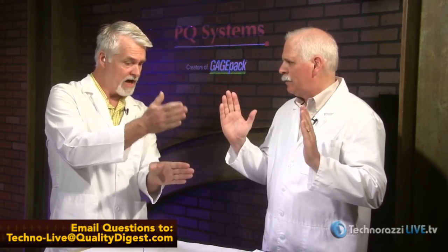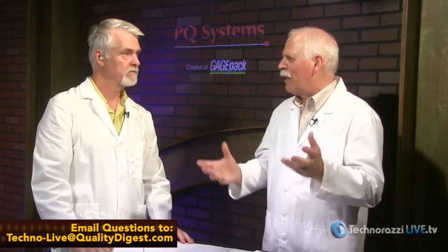So what goes in between the bottom of the planicator and the top of the surface plate? The planicator is above, and the indicator goes between the two. The top surface is perfectly level, so it should always measure 0. What you're going to see in deviation is the surface plate. Now, would the planicator rest on two stands on top of your surface plate, or would you put that on top of a bigger surface plate and bridge over the top? The planicator sits right on your surface plate, and there's a method for leveling your planicator to the plate.